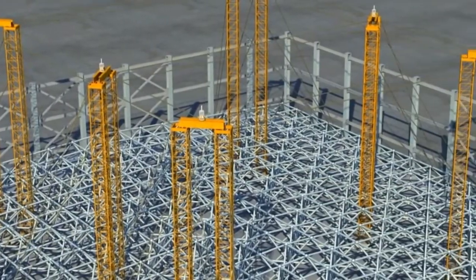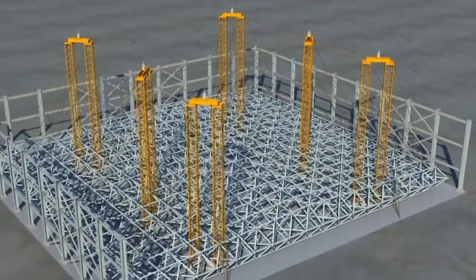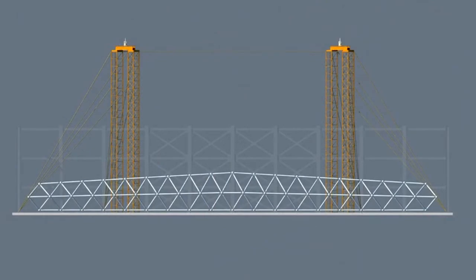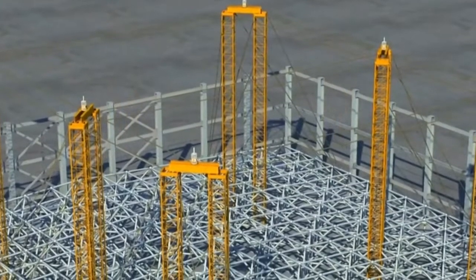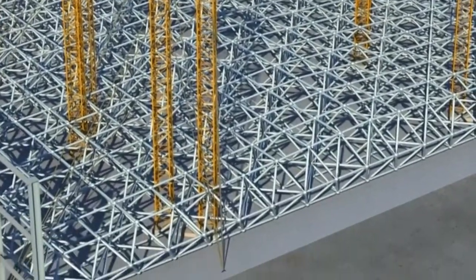Step 1: Trial lifting stage. After installation and adjustment of accessories, trial lifting can proceed. The lifting force will be gradually increased until the spaceframe is lifted by about 200 mm. Survey and inspection will be done for measuring levels of the spaceframe for verification and record. The suspension for observation will be 12 hours. If there is no anomaly in the spaceframe and the lifting system, it will proceed to the next stage.